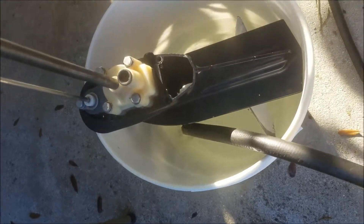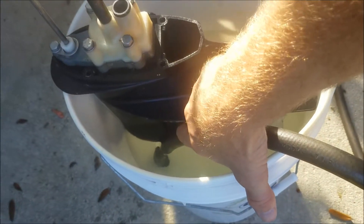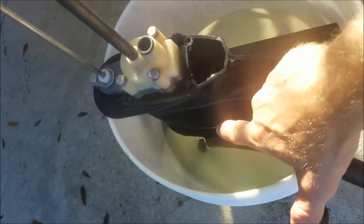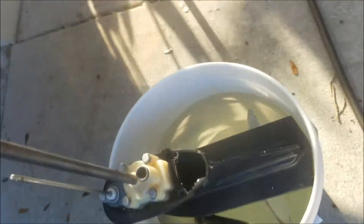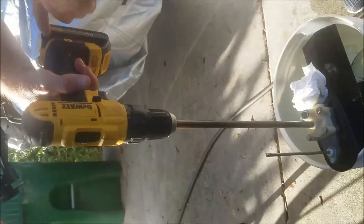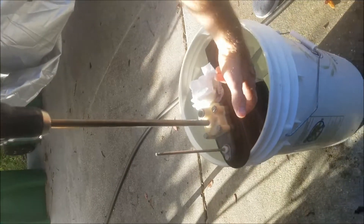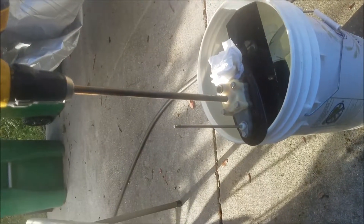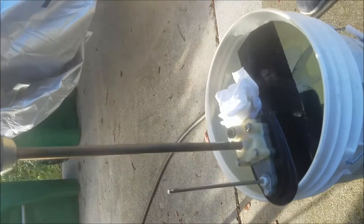I got the housing back together and I'm going to test it. I'll bring the water level up high enough — you need to get it past the vent opening at the bottom because the pump is not self-priming. I hooked up a cordless drill to the shaft — make sure it's going clockwise. Fill the water line up to just below where the water pump sits, start the drill, and you can see water coming out, so I know it's now working.